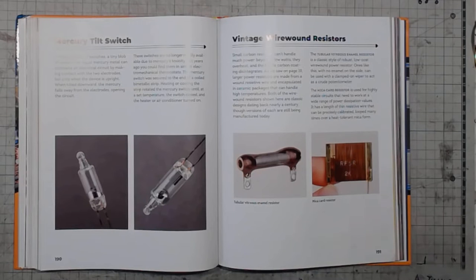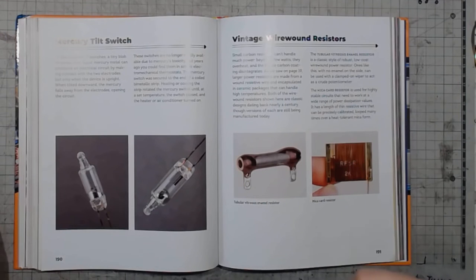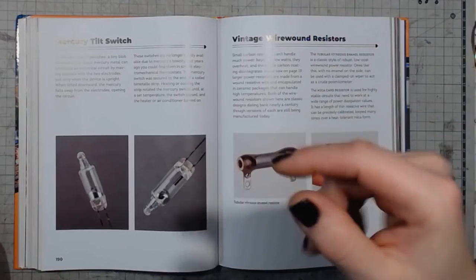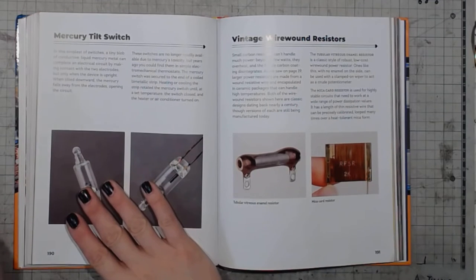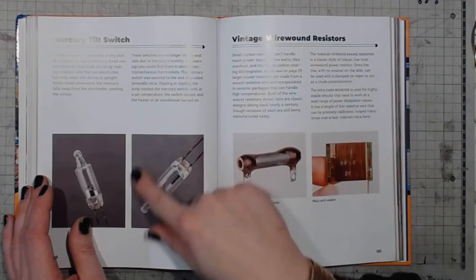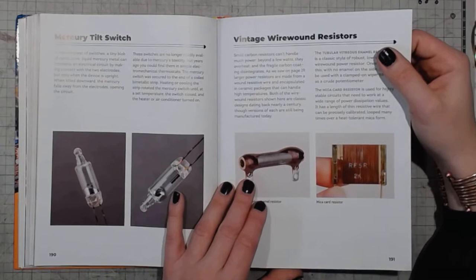They used the temperature regulators for the hot metal melting pot. The temperature regulator had a capillary tube filled with mercury vapor that contracted and expanded, and then there was a spiral bellows in the Bourdon tube that extended, and when it extended far enough, it would tilt the mechanism of the temperature regulator, tilting the mercury switch and turning the heater off. A very simple and clever electromechanical device.